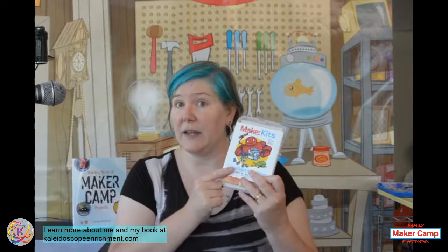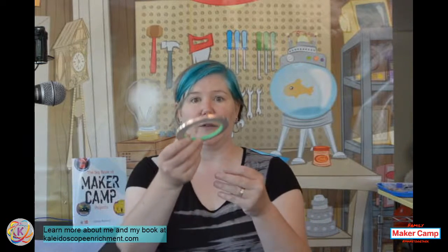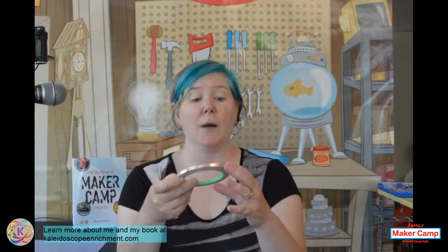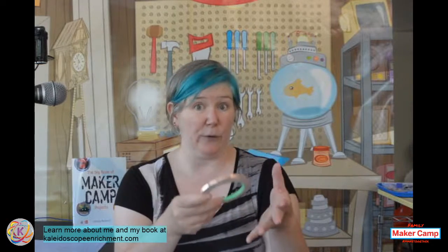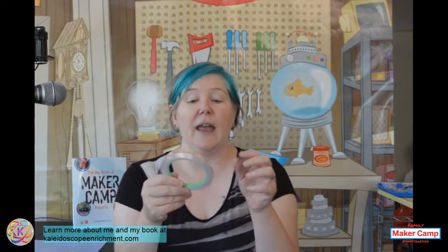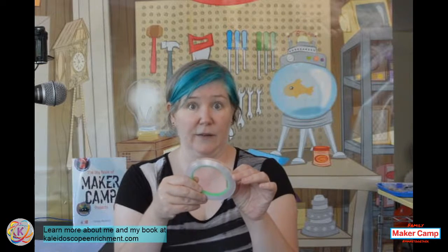One of the big differences between what you might find in the Make Kit and what you might get traditionally when doing paper circuits is copper tape. We use copper tape in paper circuits because we need to connect our power source to our load - in this case, our LED. Usually in a socket you'd use wire; in paper circuits we use copper tape, and it is conductive. The adhesive is conductive as well, and that lets you basically make a circuit on any surface. Copper tape has revolutionized paper circuits and projects like that.